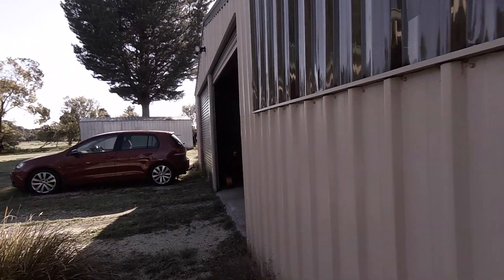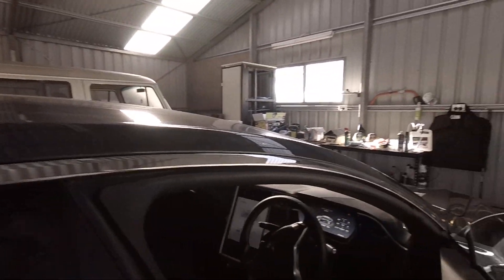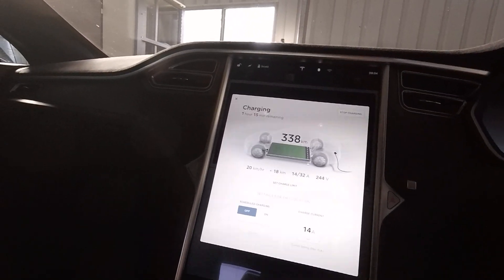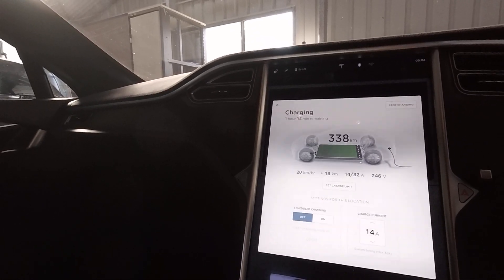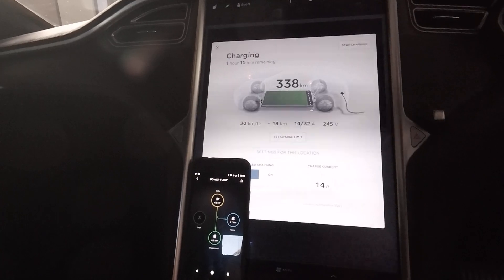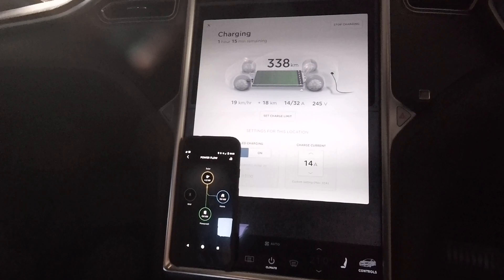What I figured I'd do is set my car to draw more power than solar is currently providing. So let's jump into the car and have a look at the settings. At the moment I'm telling the car to charge at 14 amps, which is probably around 4-ish kilowatts. So solar is generating 4.2 kilowatts, the house — in this case the car — is drawing about 3.6 kilowatts, and there's about 0.5 of a kilowatt going into the Powerwall.